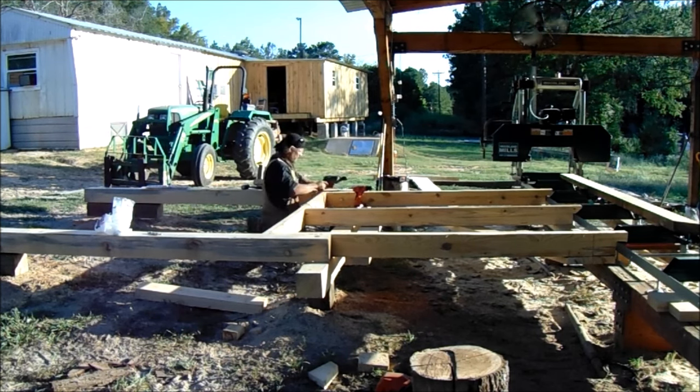And look how easy that thing drilled through there, man. That new bit, that new auger, that's a 3/4 inch hole. That's the difference from a $50 bit and a 3 for $25. That thing's sharp. It cuts and it cleans the hole. That's the main thing. With them big auger bits, when you're drilling, you need one that's actually going to pull the wood. It cuts it and pulls it out the back. So they make a big difference in them. It's nice.